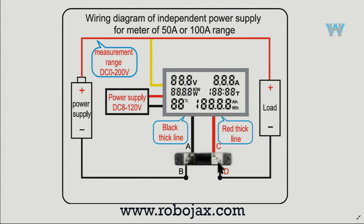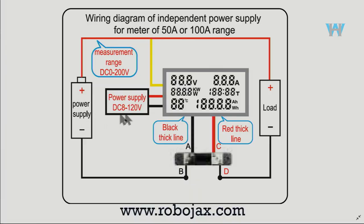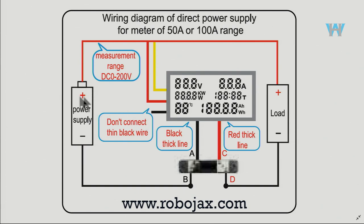The positive of your meter is connected on the side that goes to the load. If the voltage is like 0 to a few volts - say one, two, or three volts - you need external power because that's below 8 volts. But if it's above 8 volts and less than 200 volts, disconnect the black and you don't need external power. Connect red to power up the meter and yellow to measure. Remember the red cannot tolerate any voltage above 120 volts, and the meter cannot work if the voltage is less than 8 volts.